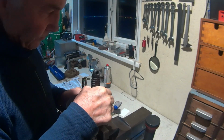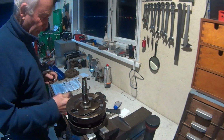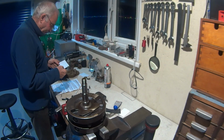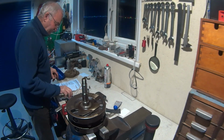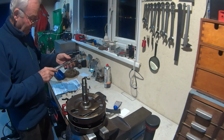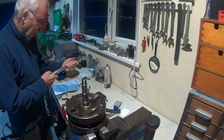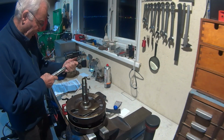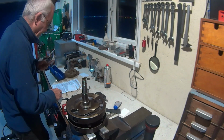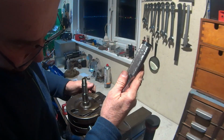And we're ready to torque. And these settings are in the manual. Here's a bit of paper I scribbled on before. So they're 25 to 27 foot-pounds. So we go in, because we can, 27. So back down. There's my 25. 26, 27. Quarter width, and here we go.